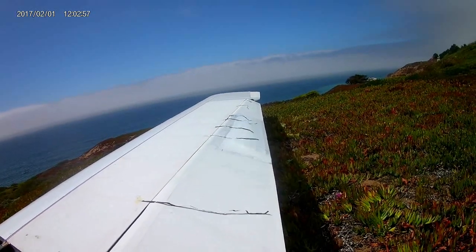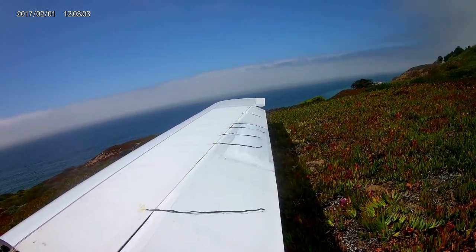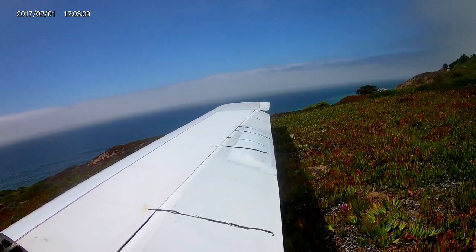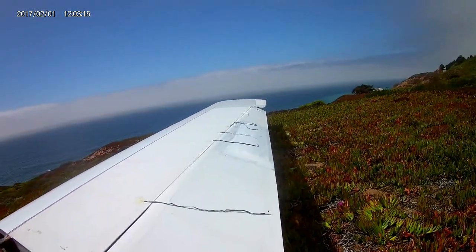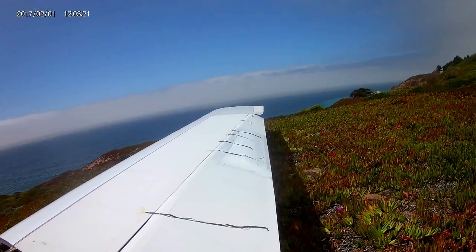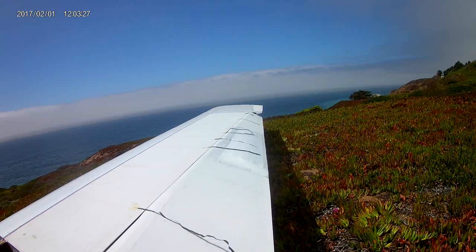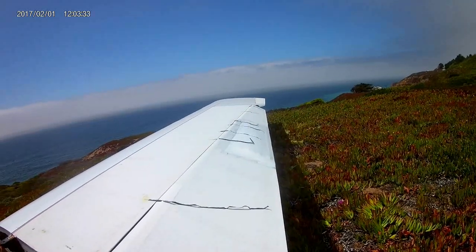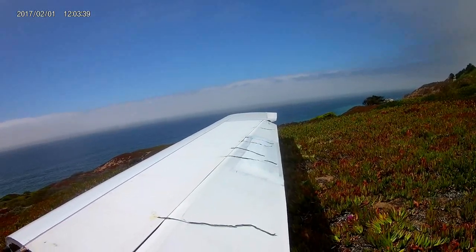What this indicates is that the previous lump I tried was a little bit taller, and that probably made a difference — we got the flow a little more accelerated before we tried to turn the corner and go back down to the trailing edge. That tells me that when I make this modification, I'll need sticks that are just a little bit taller, about an eighth of an inch. The peak of these sticks is just slightly less than half an inch; the other one was slightly over half an inch. So I probably need to add about an eighth of an inch to the overall height.